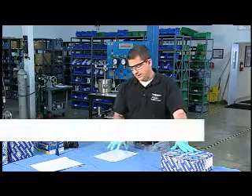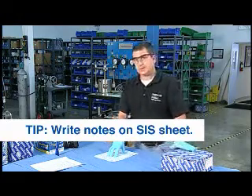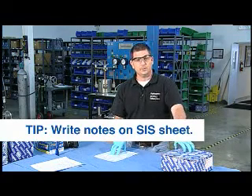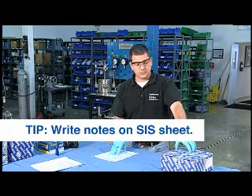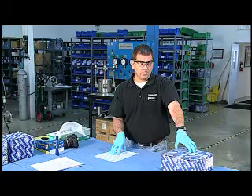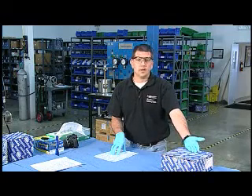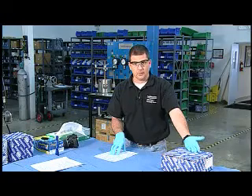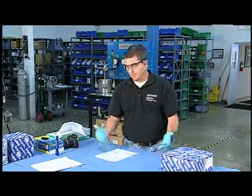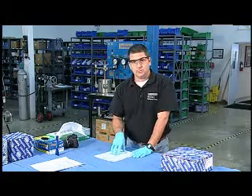One thing I like to ask my salespeople: not only should you send in the SIS sheet, but if we know it's a failure and the customer is asking for a failure analysis, jot some notes on the SIS sheet about why the seal is here and why it was removed from service. Did it fail? If so, tell me what you consider a failure to be, because everybody's definition is not the same. Maybe it was pulled on a normal preventive maintenance schedule after two years and the customer just wants to see if upgrades are required. You need to understand the objective — why is this seal here, what am I supposed to do with it? I encourage you to have your salespeople add that to the SIS sheet.